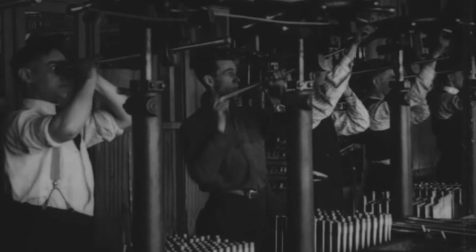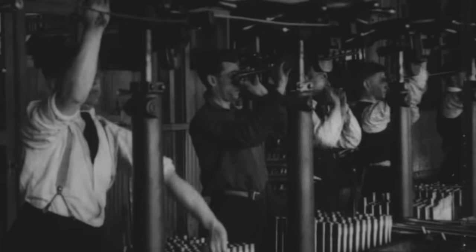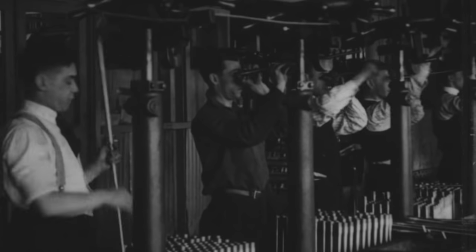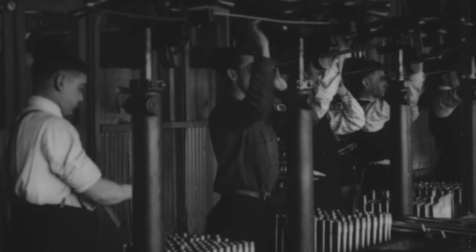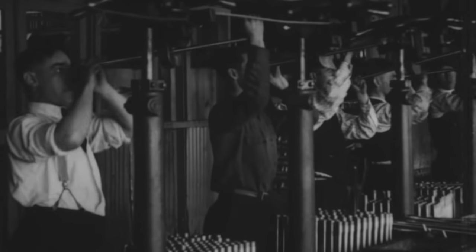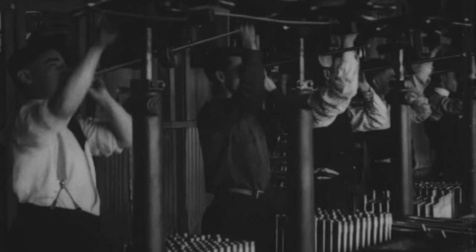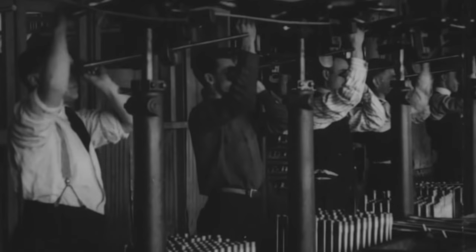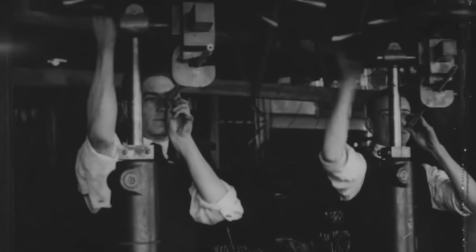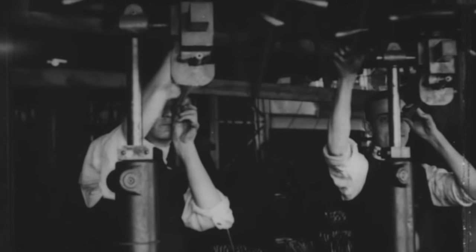I can't imagine how much torque is on that thing too. Oh yeah, and the number of barrel straightening operations was huge. I think for Kar98k production, it was something like 6 or 8. It's in the collector grade book, and it was a big deal. Something that the Brits worked out during World War II was that only the last 6 inches need to be straight, so they could do it with a plug gauge, and anyone could do it.